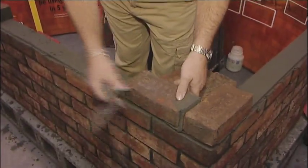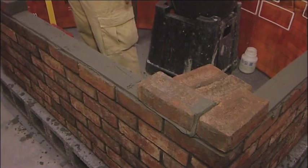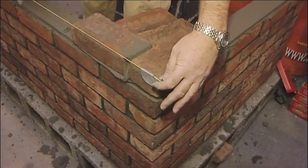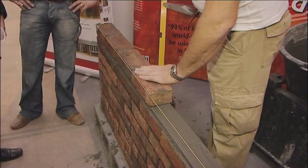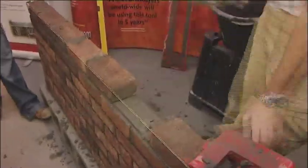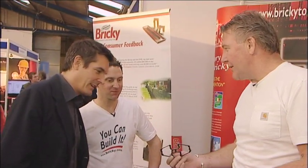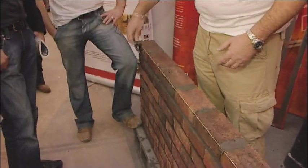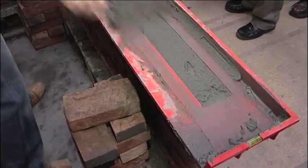Put that one in there and you've got the perfect perp each time. Squash that down — that gives you what you want. This is another invention of his. You invented this whole thing? Yes, that's right. This is clever because it's got that lip on the top — it doesn't actually fall off when you're setting up the block. Having seen the tool, would you be tempted to have a go? I would definitely be tempted. That's finishing off that joint — this is another one of his marvellous inventions. There are four different sized joints here, so once it's cured you can clean it up and get the perfect finish. If you have the desire to go out and do it, then you can achieve it. It empowers people. It's just quick, easy, and simple — and I really like that.